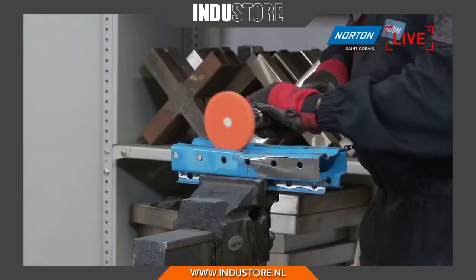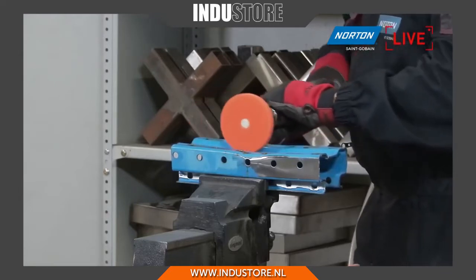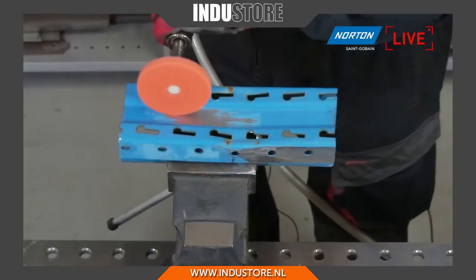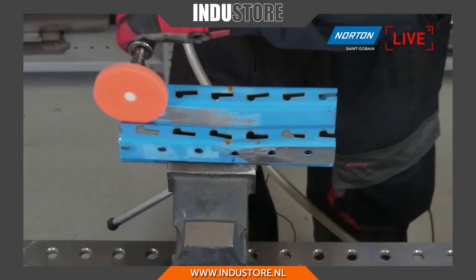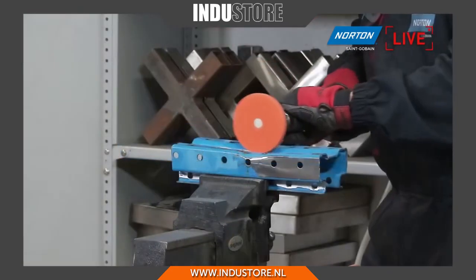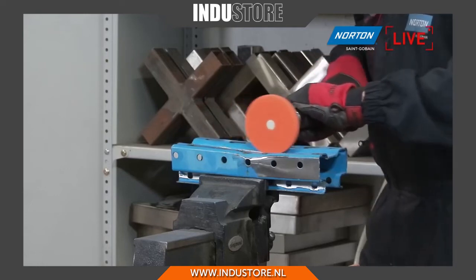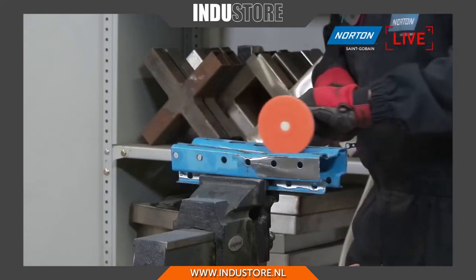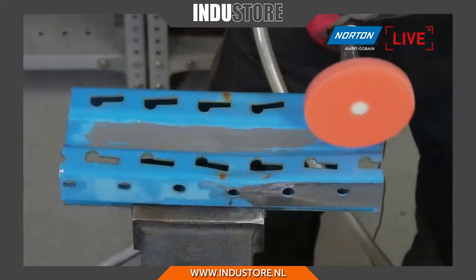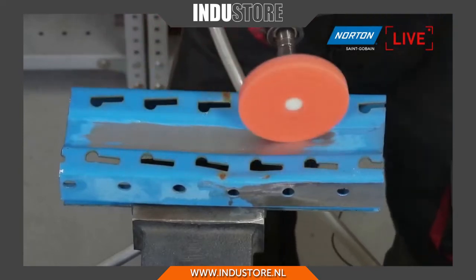Yeah, so exactly the same thing again. Paul's showing with a different tool, this time in a slightly bigger size of wheel, again getting that same access. And one of the big benefits of this particular size of wheel with that fitting and on that machine would be in the automotive aftermarket, where people need to get inside a wheel arch. So that allows them access, the straight grinder there, combined with that fitting of 100mm, 4-inch wheel, allows that great access.